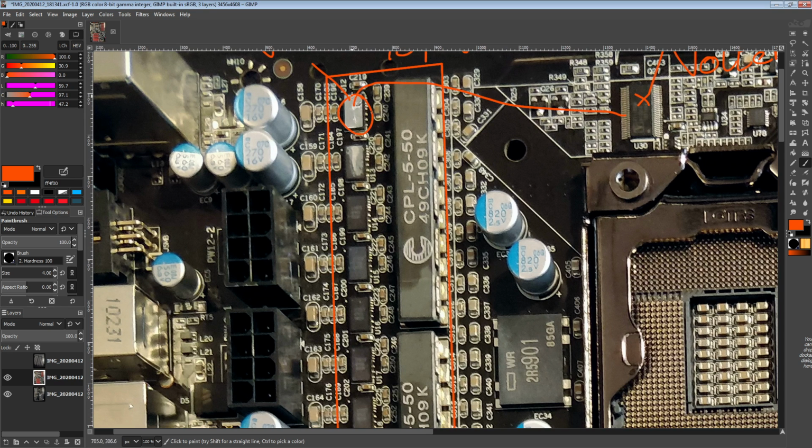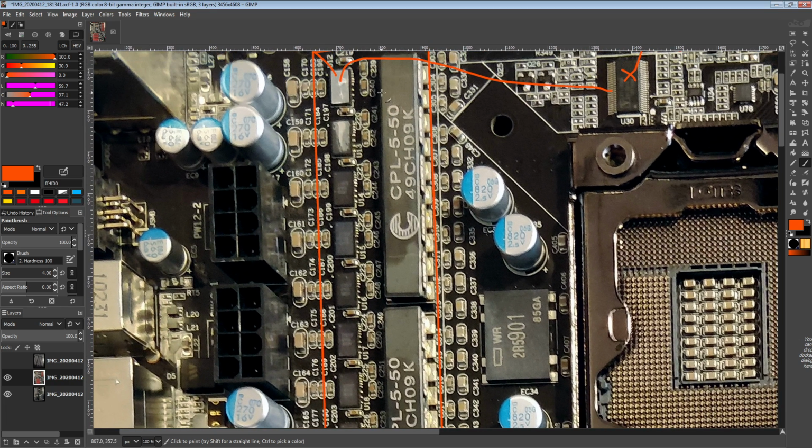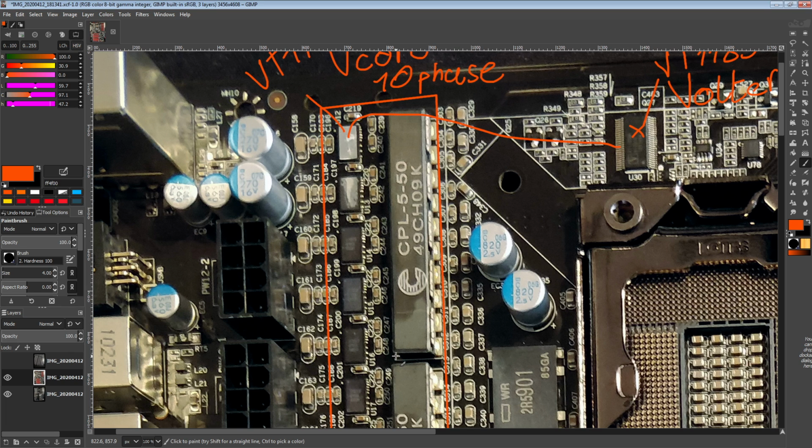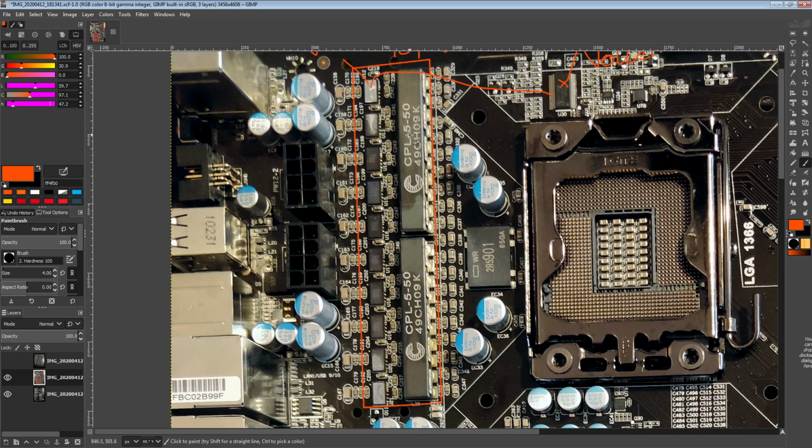So phase 1 here turns on, and current through phase 1 increases, and current through phases 2, 3, 4, and 5 also increases. And because of how this works, there's a limit. For a given duty cycle range, you can't have more than a certain number of phases in this, which is why this isn't one giant 10-phase coupled inductor, but two 5-phase ones. Because if you tried to do a 10-phase coupled inductor, there'd be some duty cycle problems that you'd run into. That would make it not work very well.